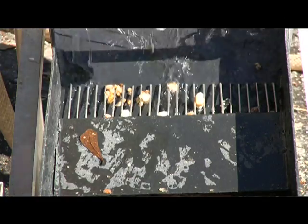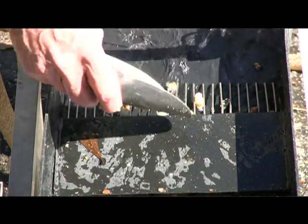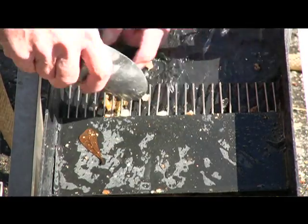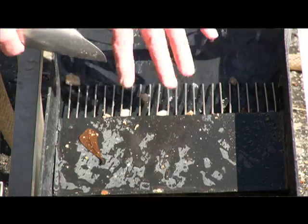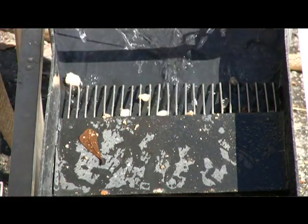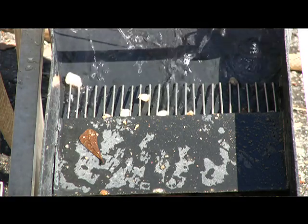A lot of people have emailed us about this grizzly, about it getting clogged up with a certain size rock. You can go for several hours with no problem. But if you do have a lot lodged up, you can just take your spoon or a stick. You do not have to keep this grizzly clean — it actually helps you if there's some rocks in here. It'll just slow that material down so it'll drop out in your trap. Leave the rocks in there until it just gets totally packed, but that is very rare, so the rocks will not hurt it.